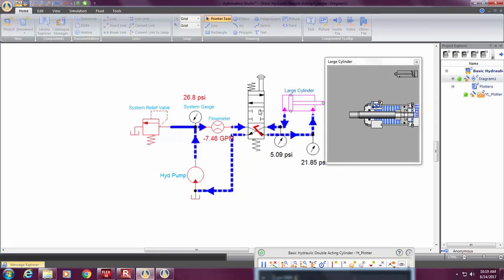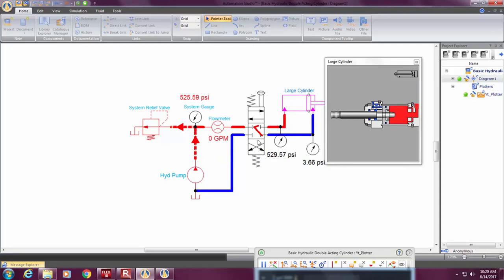What does negative flow mean, or positive flow? Well, I guess it would probably be, which way is my oil going? We can't tell the bank this, there's no negative numbers, but you can't have negative five apples. Show them to me, right? It's a mathematical concept. But when we see negative in flows or something like that, we're talking about a different direction. I'm walking towards you, that's positive, but for you, the distance is going down. Now I'm getting negative space, and now you're getting positive space as I go this way. It's just a way to define it, rather than, well, it's moving. What do you mean by moving? Well, it's moving closer. To which one? Positive, negative numbers help. The machine is moving negative, down towards the part. It's moving positive, it's moving away, however the designer developed it.